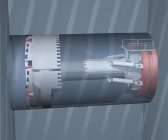This animated sequence shows how the so-called gripper functions. The automated gripper presses against the rock on the sides, and the rotating cutting head is pressed against the tunnel face with a force of 26 tons.